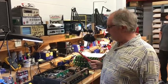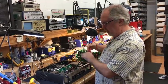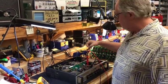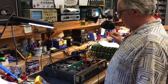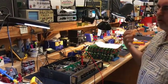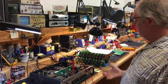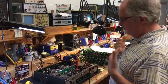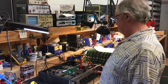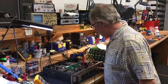I just got the final assembly — we're getting ready to fire it up. I'm using special probes that I can clip into the power supply on my voltmeter so I don't have to have my hands in there. This amp is 16 years old and it's been running for that amount of time, so there isn't really anything that needs to be burned in. However, we don't know what temperatures or conditions the filter capacitors were actually subject to. When we power it up the first time it's either just going to power up anticlimactically, or a capacitor might blow through the roof — so I don't want my hands over it when we do that.